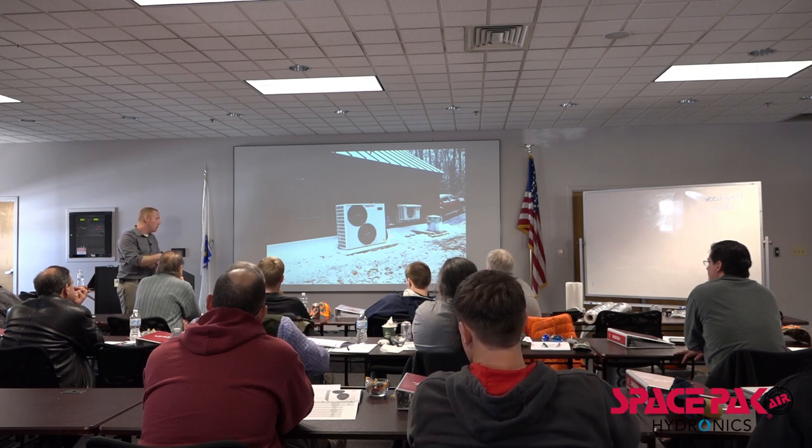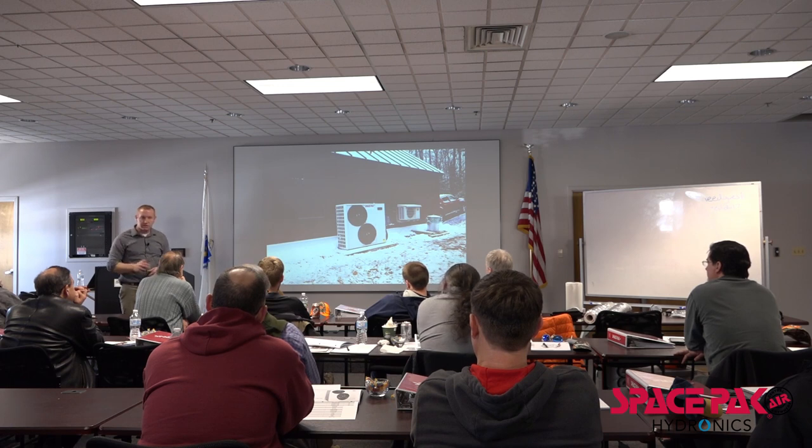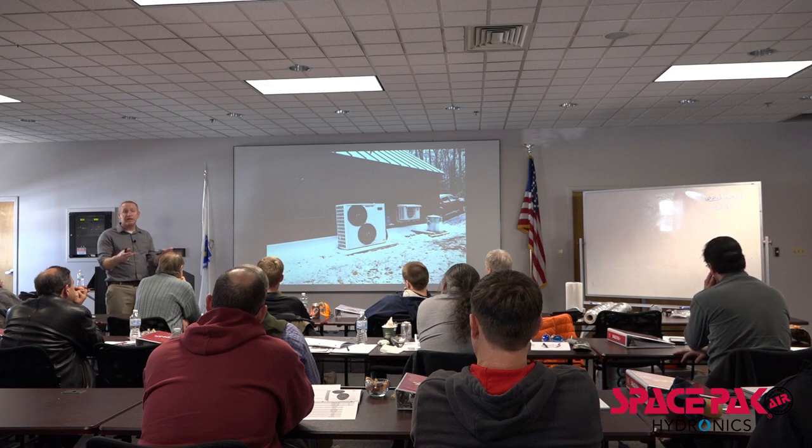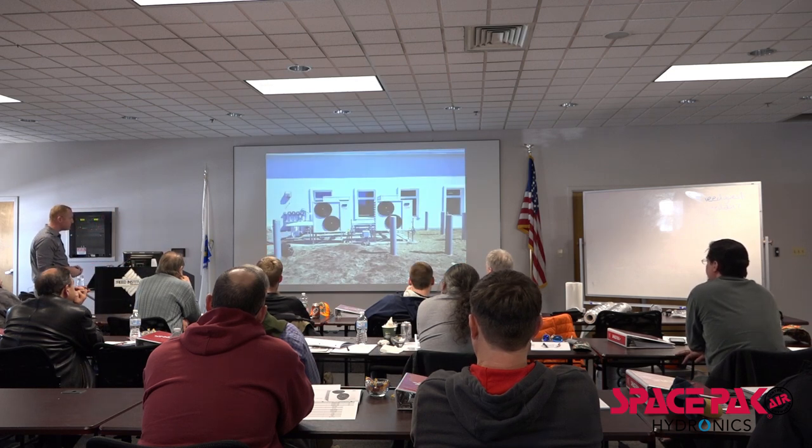You want to have it a little, most of them you'll see now, they'll be up a little bit. People like to try to get them up a little so that when the water does run out, it doesn't turn into complete ice right underneath it. It's got a heated drain pan underneath it so that nothing actually freezes inside the unit. Once it gets outside, it may absolutely freeze.